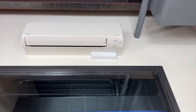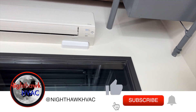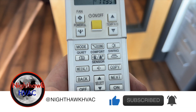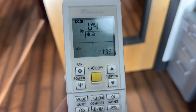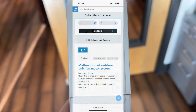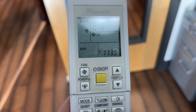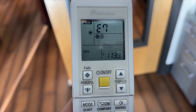We're back in the office — blinky green light, so it's a Daikin mini split. Hit cancel, hold it down, and keep hitting cancel until we get a long beep. E7 — that's going to be an issue with the outdoor fan motor. This is a two-head mini split and we're getting the same code on both, so onto the roof.